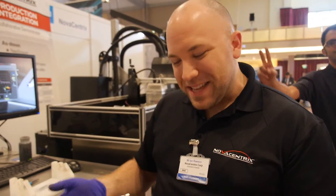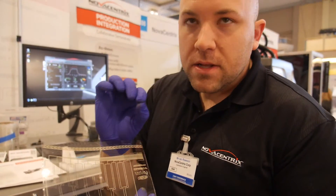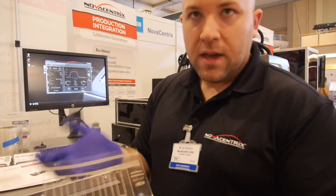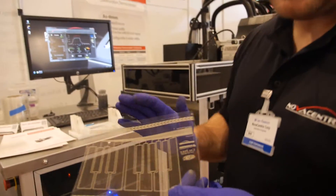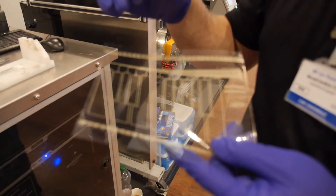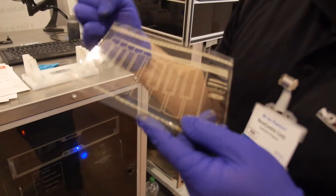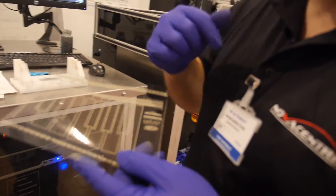Is this the best of the printed electronics world right now? Well, especially for Flexo, you have a very efficient system to use the silver as efficiently as possible — and that's key, because silver is expensive. But if you use only a little and use it very efficiently, it can actually be really cheap. One of the ways we get efficiency is with the PulseForge: a high-intensity pulse of light sinters the metal particles together, giving you a nice tough conductive track with good properties.